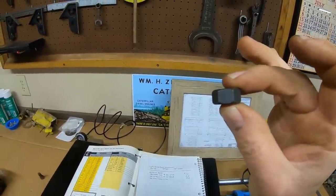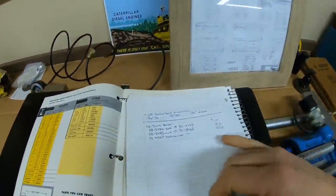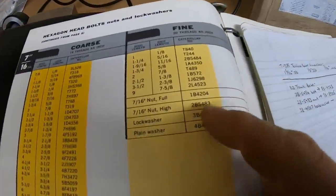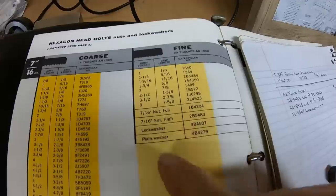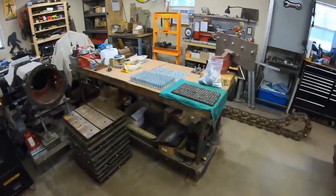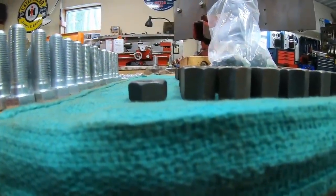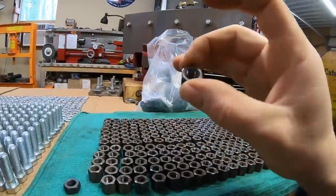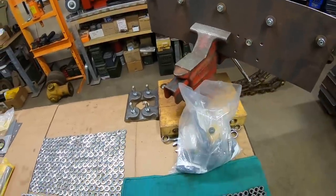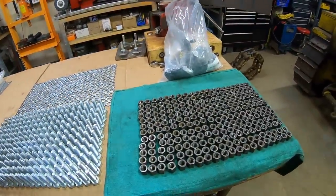The other major difference is in the design of the new nut. I could tell from the instant I looked at these that this was not going to fly — these are the new 9S8905s. Going back to the original 2B5483 number, it specs out a 7/16 nut height. This is not a high nut; that is a standard one. You can really tell the difference comparing it to the set of high nuts I have here — that's maybe two-thirds to half of the nut that the appropriate high version is. So I decided we're not going to use those new track nuts.